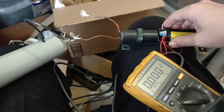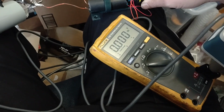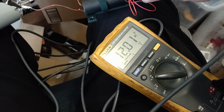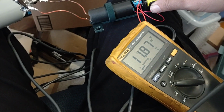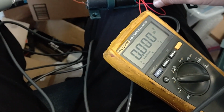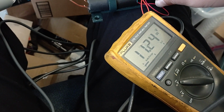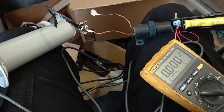So we have our high voltage probe here and our high voltage generator and DVM, digital voltmeter, and this 1000-to-1 probe. So it's a little bit less than about 12 kV. It's kind of drooping when it runs for a while. Try it again. Okay, 11,500. We'll use that as the voltage, and we'll see what the breakdown is.